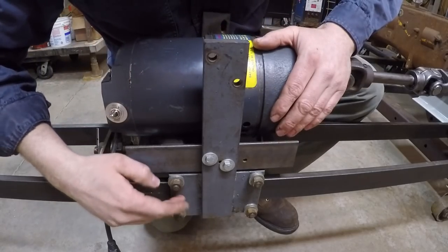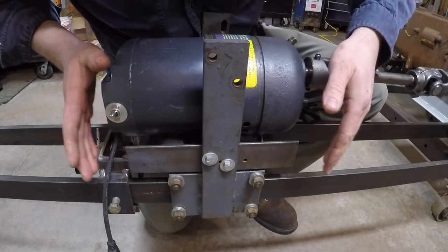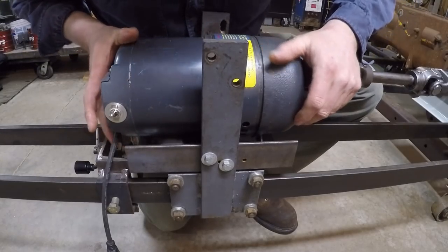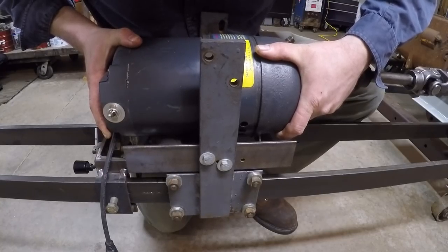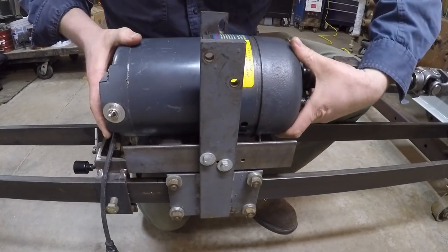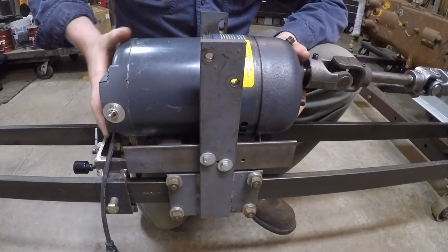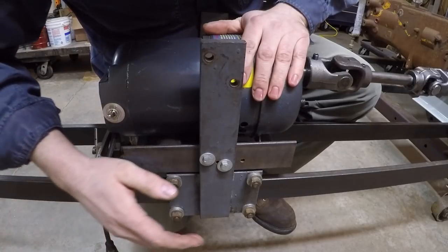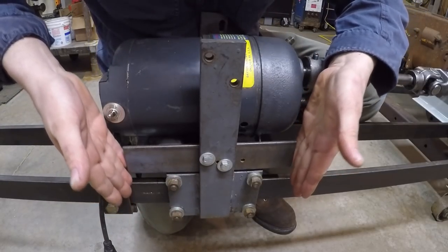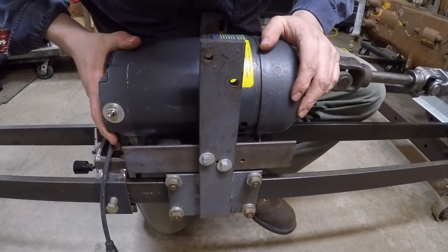Here's what I don't like about this setup. Because I repurposed these roller brackets from a different machine, they were really never intended to have a motor like this mounted above them, and they're not designed to cope with the directional forces being applied to them in this application. Coupled with the fact that I have an excessive amount of play between the rollers and the track they ride on — these rollers are not adjustable in these brackets, so I really have no way of taking up any of that slack. I think it's this excessive play that's causing my bar to kick back and lunge forward again. So I'm probably going to have to abandon these brackets altogether and make some new ones that are at least as wide as my motor mount pieces here, maybe even a little bit wider, and make these rollers adjustable so I can get rid of that excessive play.